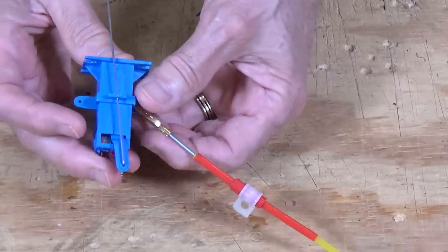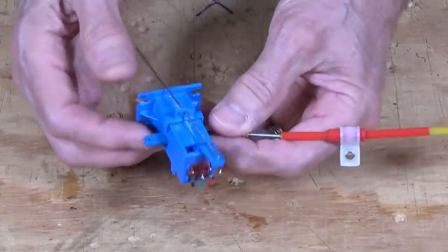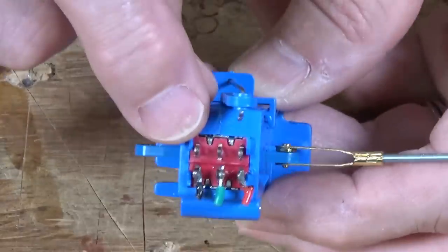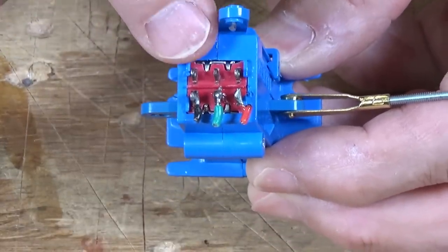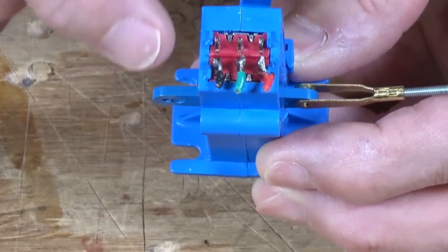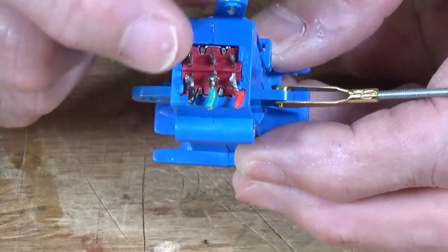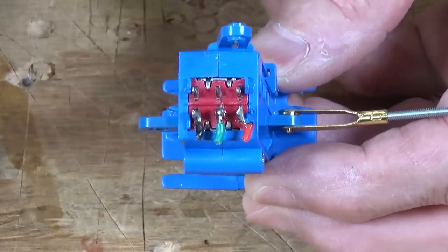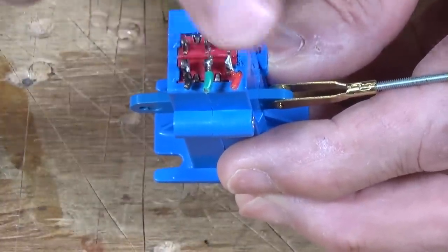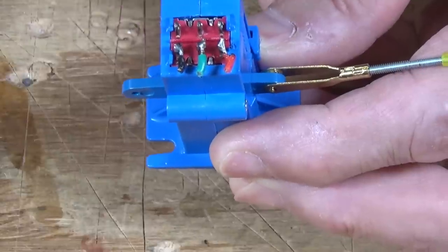These also control the polarity or the phase of your frog itself. If you look right here, there is a double pole double throw switch that you can use and wire up to power your frog. You only use half of this for controlling the power to the frog, so you could use the other half for a signal or something else. I've got red and black wires here attached to the connections.